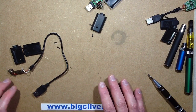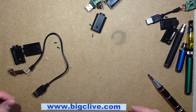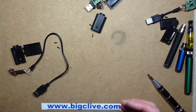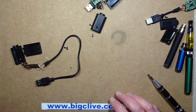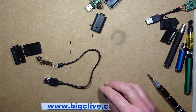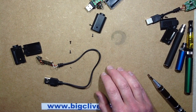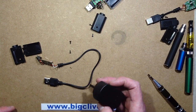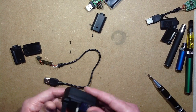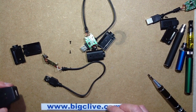In short, an electronic cigarette charger shouldn't have any need to communicate with your computer unless it has some weird functionality or doubles up as a memory stick. The way to know if something has connected to your computer is to have it running, plug the charger in, and see if it makes the bing-bong noise. If it doesn't, it's most likely just a dumb piece of electronics. If it does make that noise, there's something active happening, and the best thing to do if you don't trust it is use a generic USB charger — preferably a good quality brand-name one. The ego chargers — none of these pose any risk whatsoever.